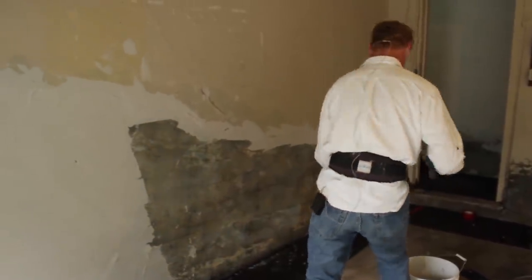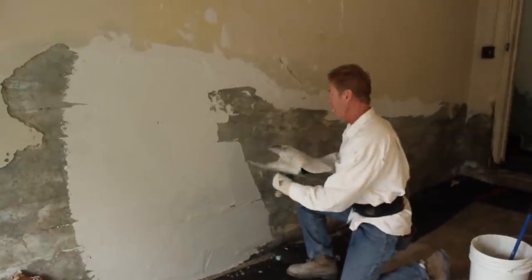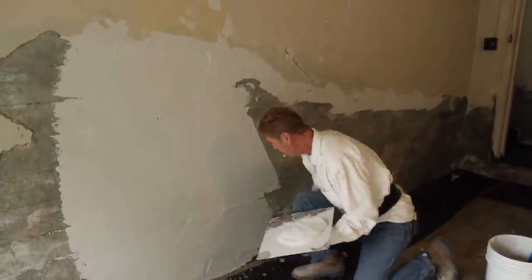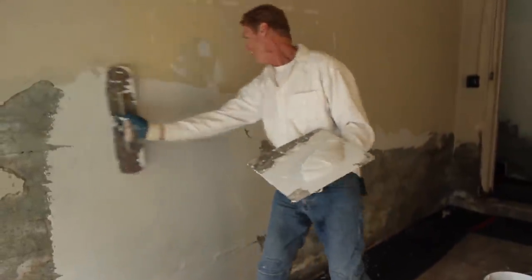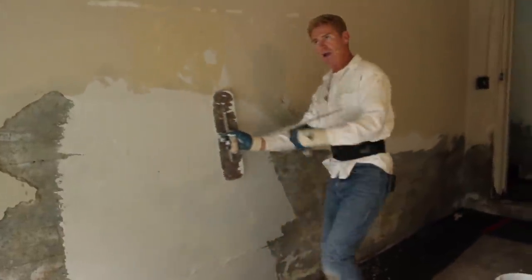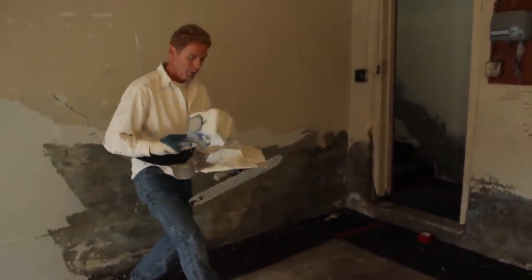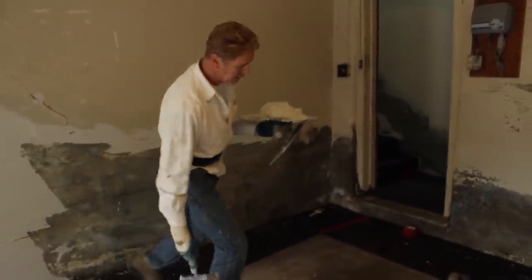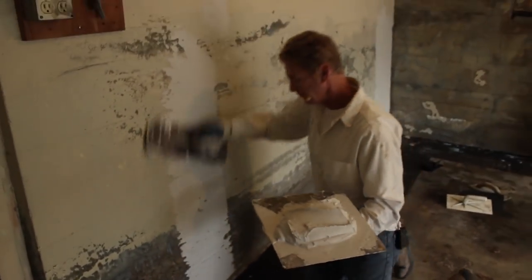The finish is easy — this is a sand finish using the base coat, and there's nothing wrong with that. As far as how thick you have to go, that's up to the wall. On sheetrock, just almost paper thin and then back it up. Go just thick enough to cover any blemishes. I'm going to skip this wall right here to spare you. The idea is you feather it in to the existing surface. What if you're going over an existing wall that doesn't take much mud — beat up, paint came off, some holidays here and there — you just skin it.